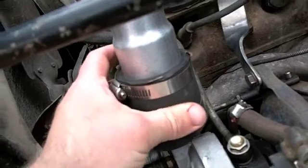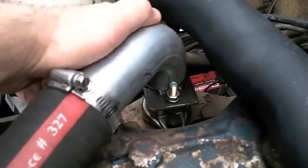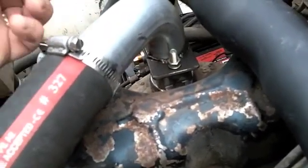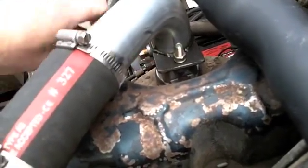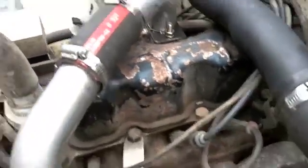The turbocharger compresses the fuel-air mixture and blows it through another chunk of that marine hose, up and over another chunk of the marine hose. Everything is isolated with rubber — up and over and down into the old intake port, using the Soldex manifold riser adapter. You'll notice there's a little bit of grease forming right here, which means I've got a pinhole under vacuum that will have to be addressed. That will be difficult because obviously it's a gasoline mix, so I'll have to pull, clean, and re-weld.